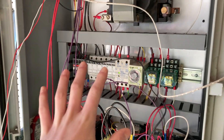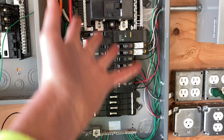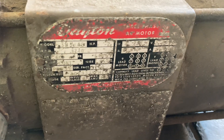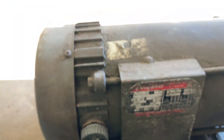So what is a rotary phase converter? Very basically, it takes single-phase power — because in the US we only have single phase — and it makes three-phase power. Three-phase power gives you two extra live wires and has a sense of rotation, so it's really good for running motors. Here's a little motor — it's a three-phase two-horsepower motor and it runs super efficiently on three phase because of that sense of rotation. If you don't know about three phase you can look it up on your own.